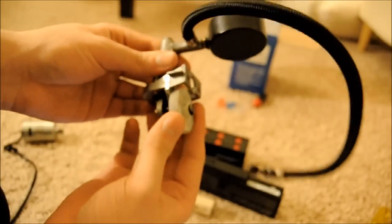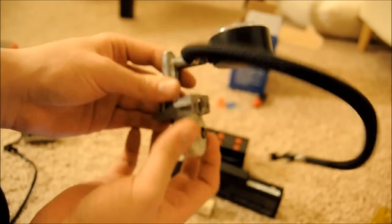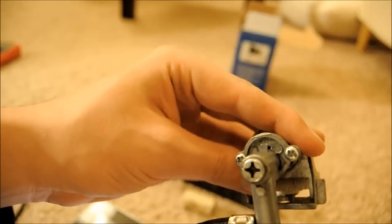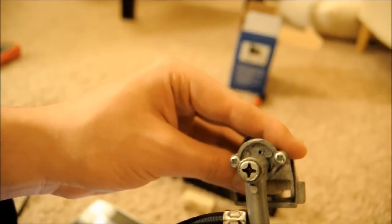If the cylinder cranks turn with resistance, you can take off the cylinder head and check the condition of the piston. If it looks alright but still doesn't work, try to throw a drop of sewing machine oil or even olive oil in the small hole you will notice on the top.